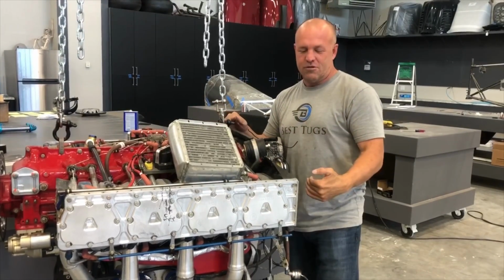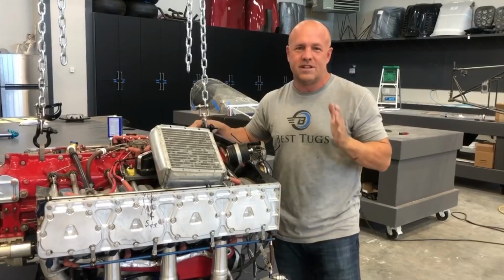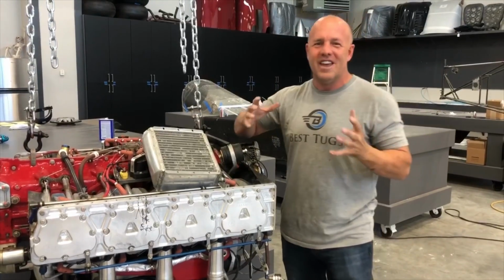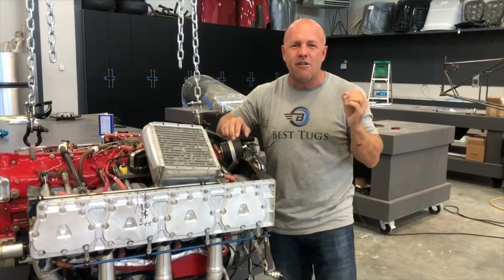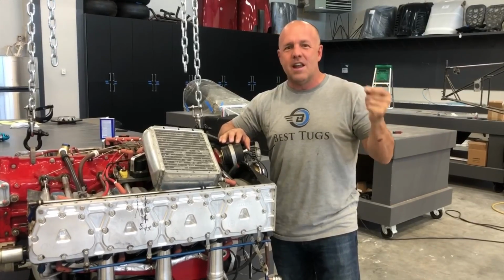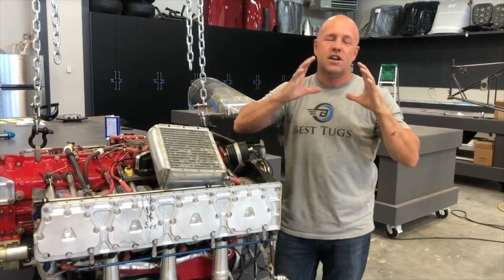The other reason my oil coolers can't be here, I did a real basic calculation on airflow into the engine to cool the cylinders. And I've done a whole lot of aircraft, a lot of race planes, and I actually consider myself pretty good at airflow. And you can take any given airspeed and you can calculate exactly what maximum compressibility of air is at a given airspeed. And with that number, you know how many inches of air pressure you can build inside of a sealed plenum given a certain opening.